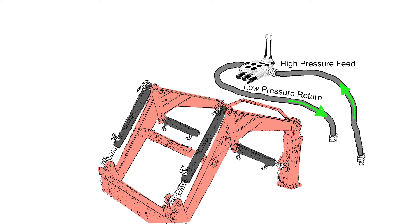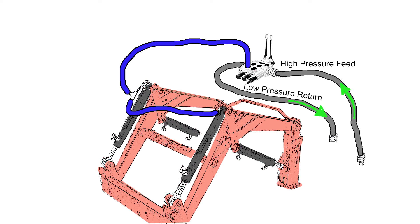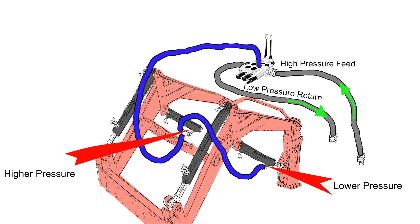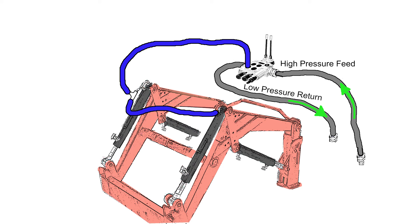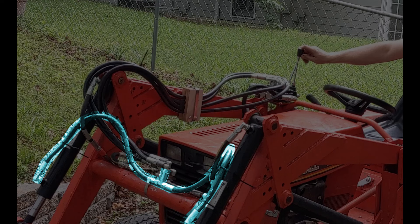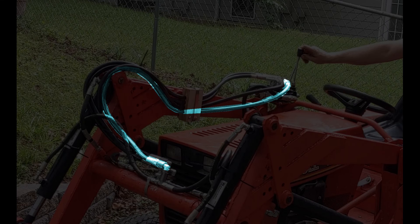I initially had planned to connect the cylinders in a daisy chain scheme, whereby for any given pair of cylinder ports, you connect a T to the nearest cylinder port, then pipe directly from the valve to that T, and then pipe from that T across the tractor to the matching cylinder port on the other side. It occurred to me that that scheme might be problematic — one part of my intuition tells me the near side port will be subject to higher pressure and more oil flow, which will tend to distort the frame. The other part tells me that at pressures above 2000 psi, the differing hose length is an insignificant factor. So I chose to go with a center tapped piping approach, which I believe will minimize the frame distortion issue.